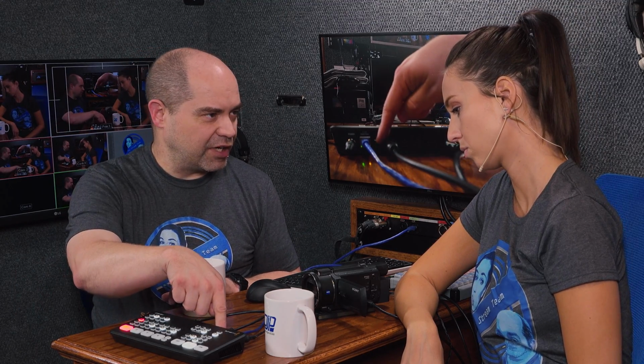It's labeled webcam out, but it actually can be used to control the switcher from the software as well. So either one, yeah. I actually recommend going with Ethernet. It's a little more flexible. You can connect multiple devices if you want to have two people have control over it, or you wanted to invest in an external tally system, or any other number of things that know how to talk to the ATEM switchers. They're all going to do it through the Ethernet instead of the USB. So yeah, it's a better way to go.